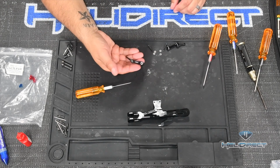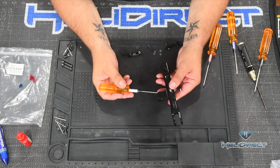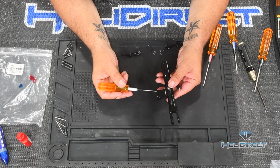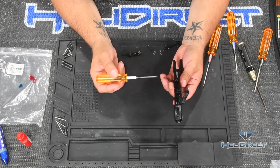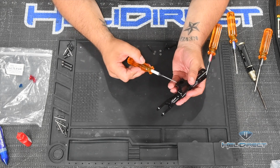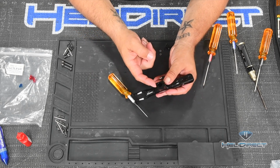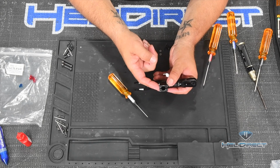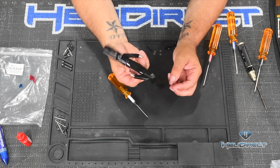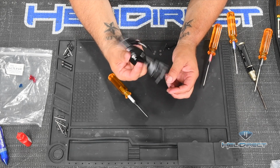So this radius arm is pre-assembled, and on each side here, there's a side with some threads, in this case right here, and a side with no threads. The bolt will go through the side with no threads, and it goes across here and screws into the side with threads on the opposite side. Now, when this bolt is going across here, we call these pinch bolts, this gap here that you can see in the base here will pinch this onto the main shaft, which is the shaft that this rotates around, and where the force of the motor is transferred through gears onto the shaft.